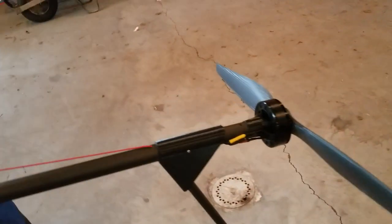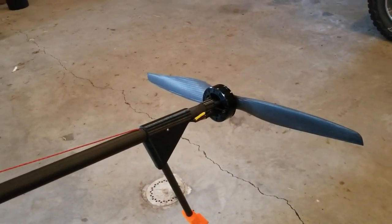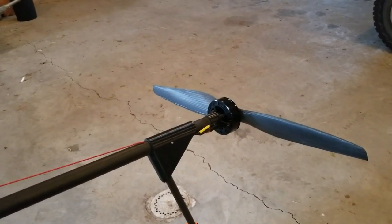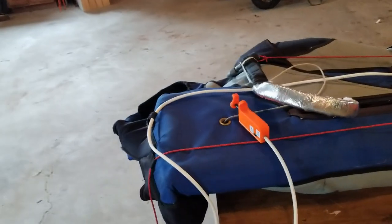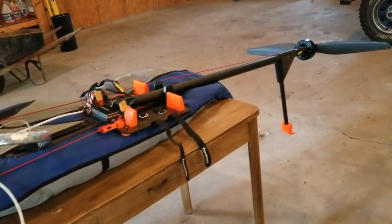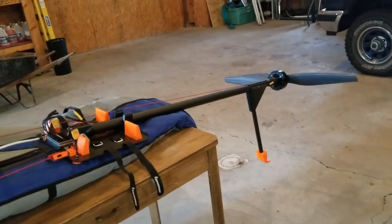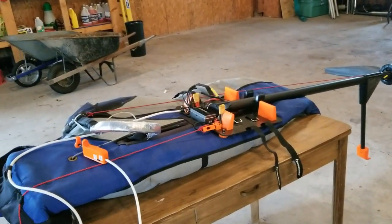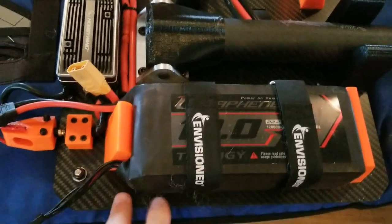I can post a link to that video. I basically flew a Falcon 140 and was able to get airborne — albeit only maybe 5 to 10 feet — and climbed about 50 feet a minute. I've never gone prone, so I think if I got prone with this, an extra 8 to 10 kilograms of thrust with a higher pitch on the prop should be able to climb at least a couple hundred feet a minute. Putting the two batteries in just to show you what it looks like.